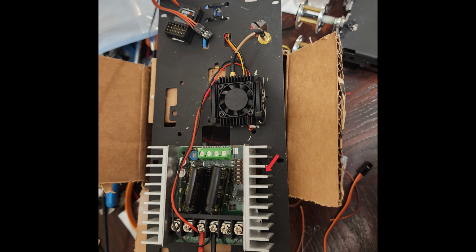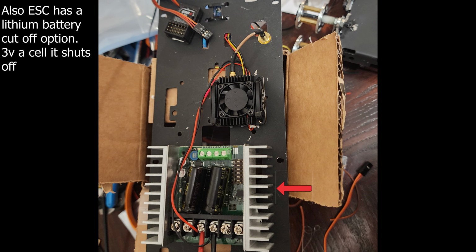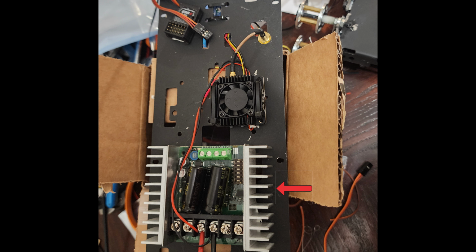But so I end up using a Sabertooth Dual ESC, so it can control both motors, and it has an option on it for a mixer, so that you can use throttle and a steering wheel instead of one stick controlling left motor power and one stick controlling right motor power. So it makes it hard to kind of go straight and hold the sticks both at 70%. This way it makes it easy. Modern tanks are like that now. They have steering wheels and a throttle.